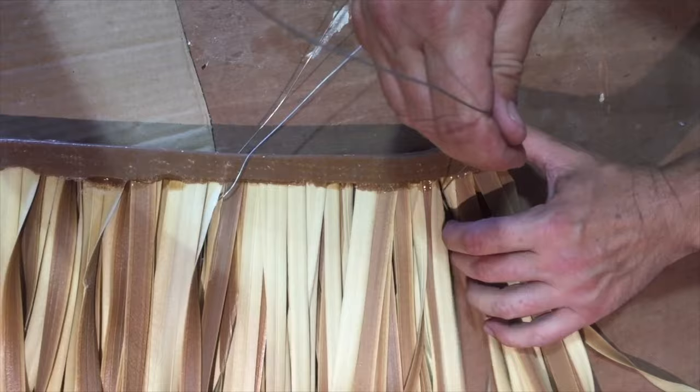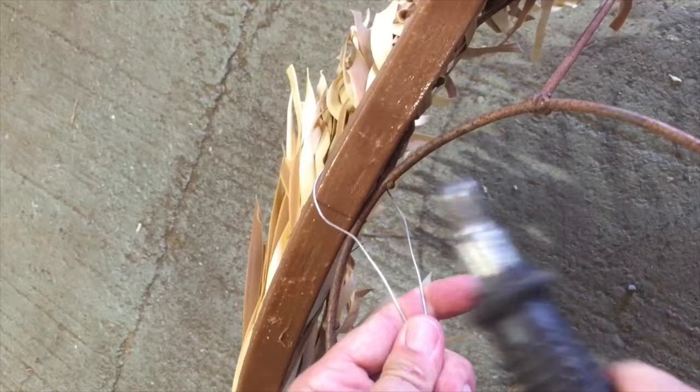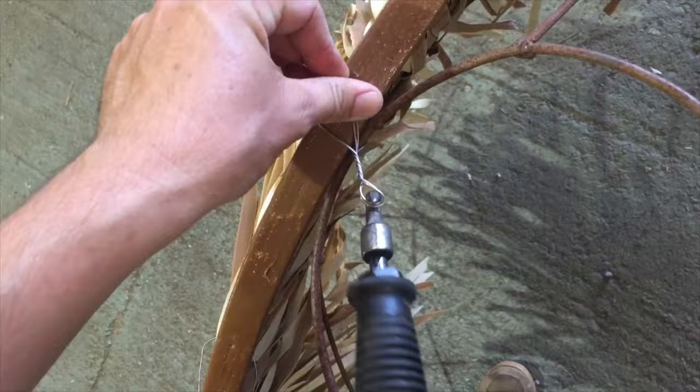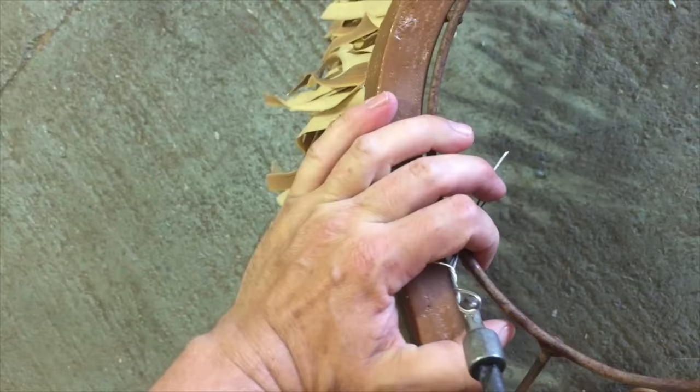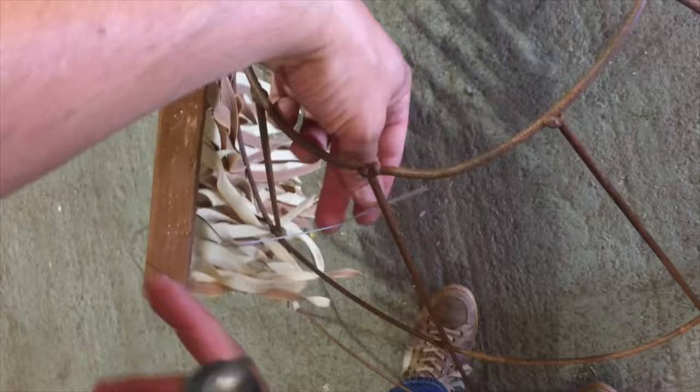You will need one a couple of fingers' widths from each end. The wire is then simply passed around the baton or roof structure and twisted to secure the tile. We can supply you with a special tool for this which allows you to twist the wire very quickly and easily. Note how both pieces of wire are passed through the hook and then the tool pulled to twist the wire. Don't twist it too tightly or you'll find the wire will snap.